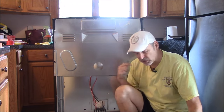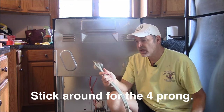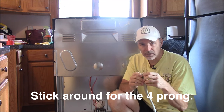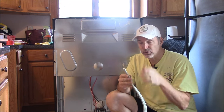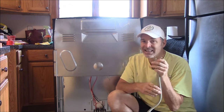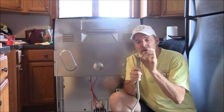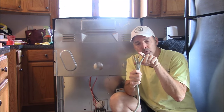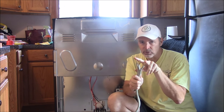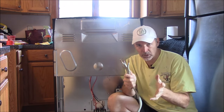The stove I'm going to install here, I have to put on a three-prong. On the three-prong, there's going to be a neutral and two hot wires — a black and a red. Now, if your cord is color coded, just hook them up according to the colors. If it's not, it doesn't really matter. The middle one is going to be the neutral and the outside ones are going to be your hots, so just hook them to each of the black and red terminals. It doesn't really matter which one is which.